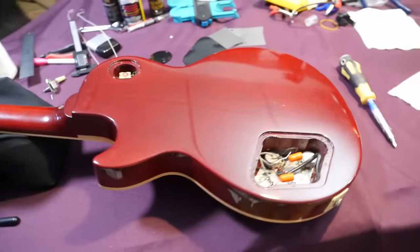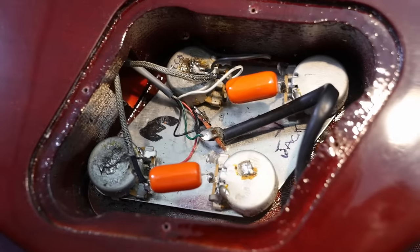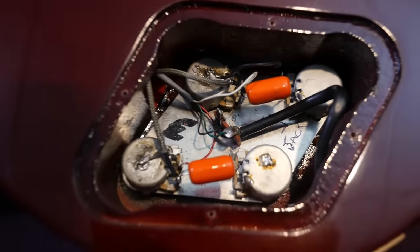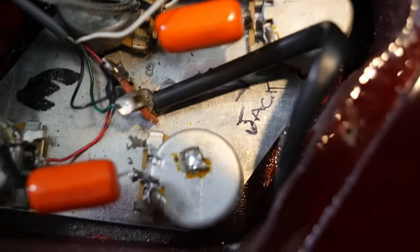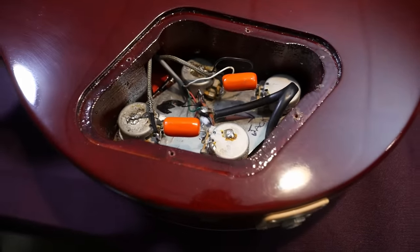Now back here, we've got a couple of additional red flags, but let's go in here. So the back control plate. Obviously, this is Gibson USA stuff. They have the metal base plate. Now, sure, we could take that off, wire it back up, clean up the solder job, because these are just appalling. Put the style of pots that they actually put in a real Snakepit to make this an even more convincing fake at that point.